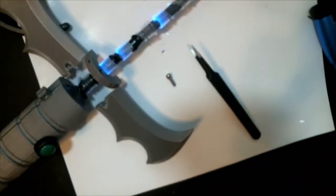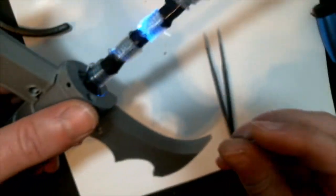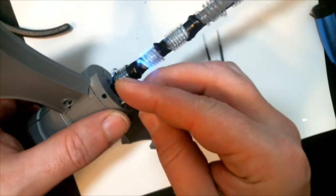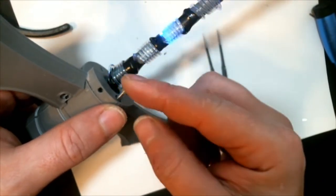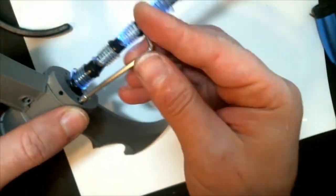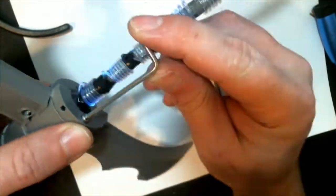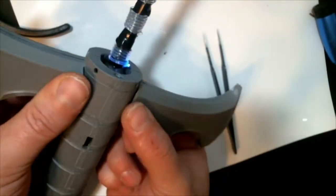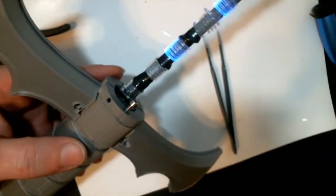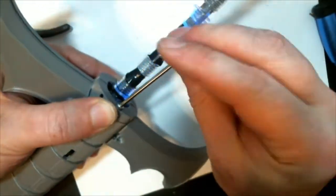Now this top part, I think it's important to put this top bolt in. If the guards break or separate from the part that holds the blade on, then your blade could fall off, because the blade actually bolts onto these additional parts up here. That's what the holes on the edges of them are for. So get those in, and then we'll take one.